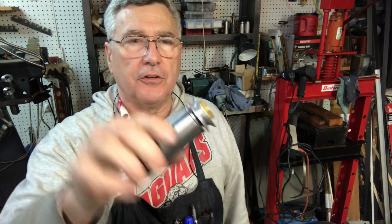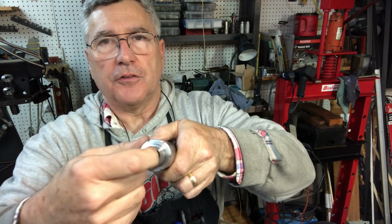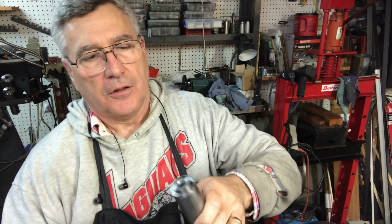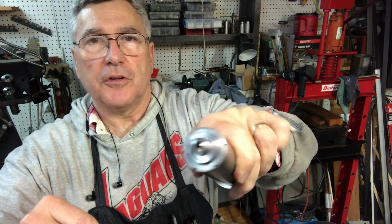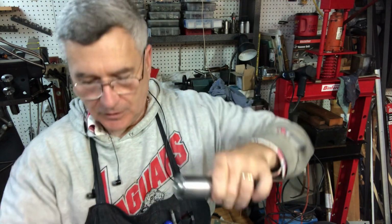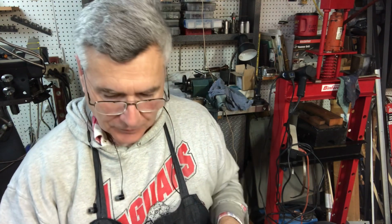In this week's episode, you're going to see the finishing touches of putting the spindle together. I just finished machining out the little 40-degree taper in there so it fits the WW collets that I'll have to make for my mounting pieces, but there's a WW collet in there. Obviously, I'm not going to be using these to hold the grinding things unless I have a tiny grinding stone or something like a Dremel. But those are Shoreline collets. I got them to test fit with.